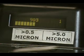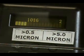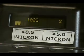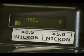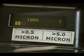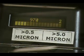Now let me put a brand new filter in. You could offer that service to a customer — show them after one month, after two months, after three months. With a brand new clean air filter, the static pressure is 0.47 and it's using 286 watts. That alone could be a business — telling customers when to change their filters based on energy costs and efficiency.